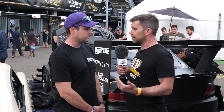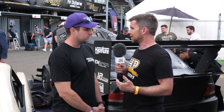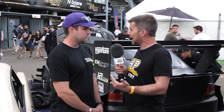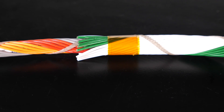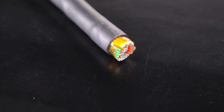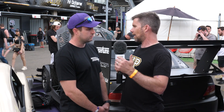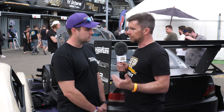You mentioned concentric twisting — anyone with an interest in motorsport wiring has probably seen a photo of a concentrically twisted harness. Can you talk us through what it is? It's basically wires twisted together in different layers. It provides strain relief and flexibility for the loom so you can go around corners with no strain in the wiring. One of the reasons we get that flexibility is that the individual layers can slide or move relative to each other, and the strain relief ensures no individual wire has any more strain applied to it than any other.